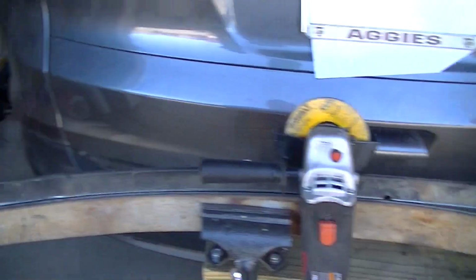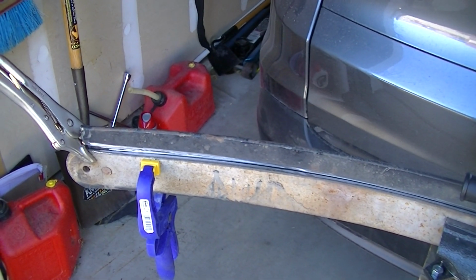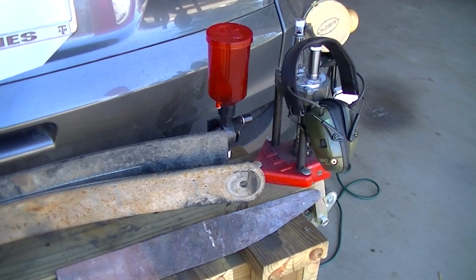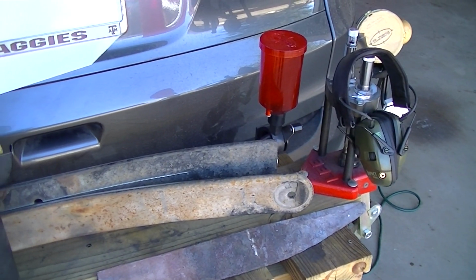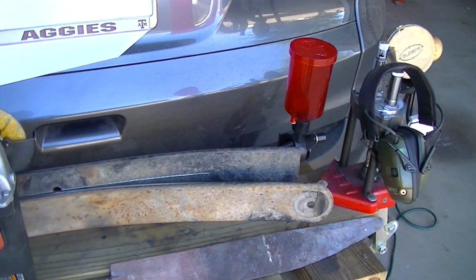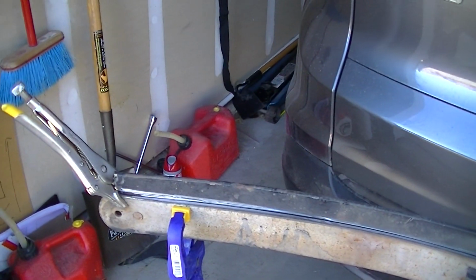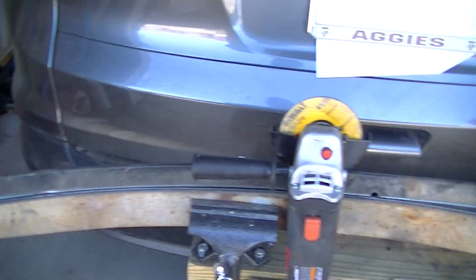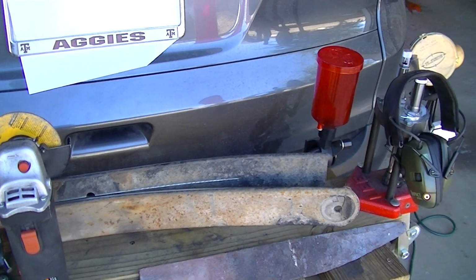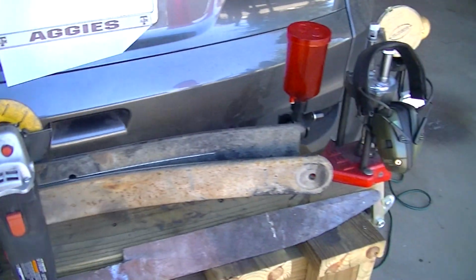So I'm going to cut the leaf spring up, which, by the way, in the apocalypse, you'd probably be using a file and a hacksaw to cut these leaf springs into blades anyway. Then you could use a campfire to get it really hot and straighten the steel out using a flat piece of cement pavement and a hammer to flatten it out. So I'm just cheating with the power tools by cutting it out, which you could totally do. I've cut up one of my other pieces with a hacksaw. It just takes forever. So more to continue.